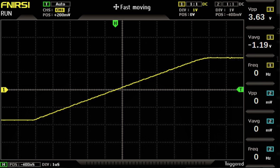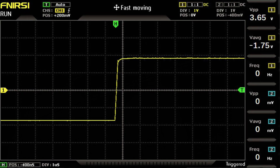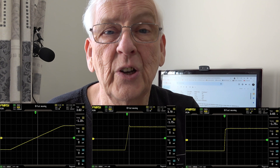The first oscilloscope capture is the LM358 — slow as hell, absolutely useless for modern audio. The second is the very well-known NE5532; bearing in mind the display is quite stretched out for detail, there is a tiny bit of overshoot. All of these are done with 10 kilohertz square waves. The final shot is our current favourite, the LME 49720: no overshoot, very fast rise time. I'm only sorry we can't come up with a circuit diagram or PCB for using this rather special IC. Maybe one day, but in the meantime, stick with what we know. Thank you for watching.